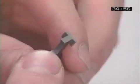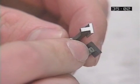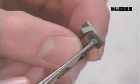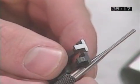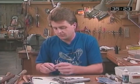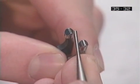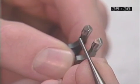And then after you get that done, you can go to this back part here. And this is the part that the spring itself lays on. And you can see the marks here from where the spring had been riding on it right there. And you want to just take a file and just remove just as small an amount as possible off of it to clean it up and just polish it out with a polishing stick. And then you have to do the same thing to the end of it. Up here you've got casting marks that run all over the top of it from one end to the other.